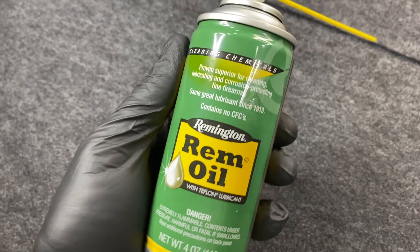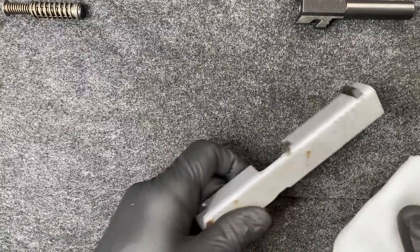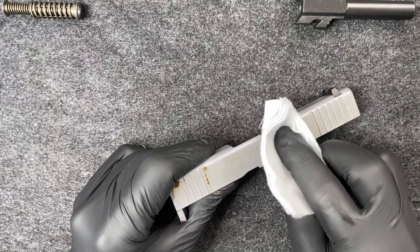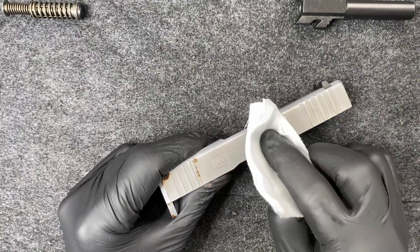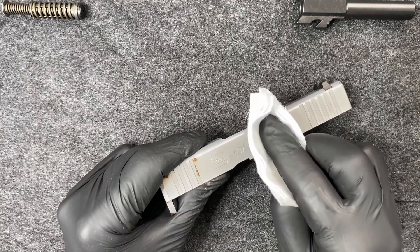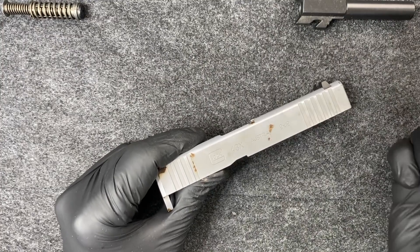What I want to show today are two different processes for taking rust off your guns. The first process I grew up on: you put a little bit of CLP on there and gently try to get it off with a little circular motion, not bearing down into it — because with surface rust you don't want to grind that into the finish. You keep checking, and once you get the bulk of the surface rust off, you go ahead and bear down a little more.